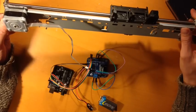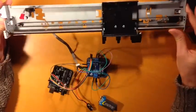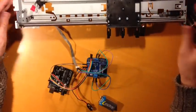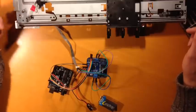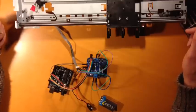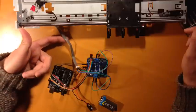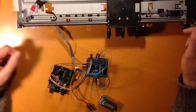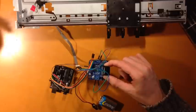It's called EM483. I had tried really hard to find something about it on the internet, in the forums and such, but I couldn't find any datasheet. So it was a trial and error thing. I just hooked it up, drilled my own holes. Looks pretty crappy, I know, but just to get it working. And I found out just by playing around that this is a bipolar motor. It has four cables going into it, and I'm driving this stepper with a regular DC motor driver.